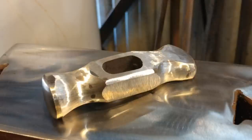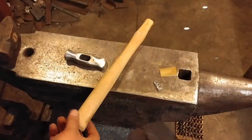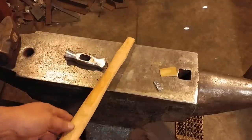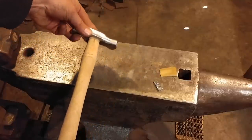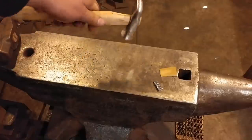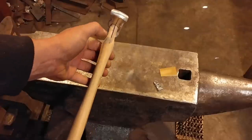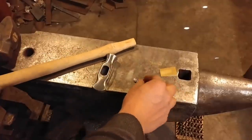Welcome back to the workshop. Today we're picking up where we left off in the last video, where we had just finished grinding the head of this hammer. I've got it all finished up now and we are going to mount this on a 16-inch ball peen hammer handle. I chose a ball peen handle versus a regular hammer handle because it has a little thinner grip, and I want a little more whippy action.